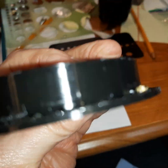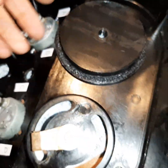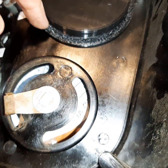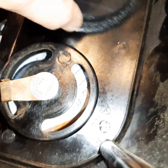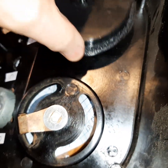I'm going to increase the thickness so that I have a full thickness of plastic, because it's on the backside and nothing hangs down below any of this. So I'm going to make that a couple of millimeters more - it'll be four millimeters thick on that flange, and that'll give us a little more beef as well.